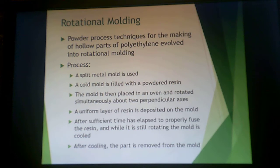The main processing method for cross-linked thermoplastics is rotational molding. The resins are more expensive than standard pellet polyethylene because you have to powder the polyethylene into very small particles, and you have to add organic peroxide to it. Also, if you have a large quantity stored in a warehouse, the organic peroxide will eventually start to degrade. So even though they're polyethylene-based, there's a lot of post-processing that goes into making those powders.